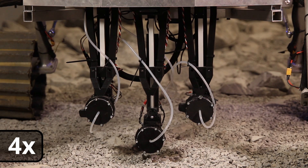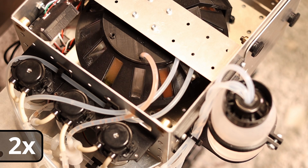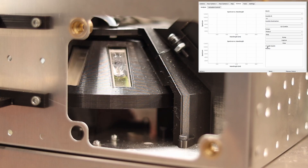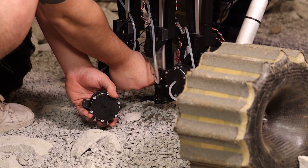This solution is delivered to the onboard science laboratory by the same pump using a series of check valves. The laboratory contains a centrifuge with 14 cuvettes. For each sample site, the centrifuge contains two cuvettes: one empty cuvette for detecting biological chromophores and one containing a colorimetric substrate to detect peroxidase activity. Sample solutions from each site are examined for organic compounds by the spectrometer. Data is sent back to the base station and displayed on the GUI. After determining the samples of scientific value, the scoop drums can be easily removed from the collector mechanism for further testing.